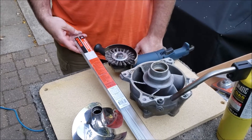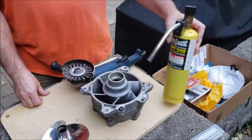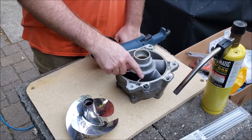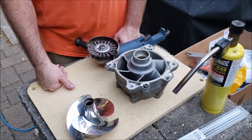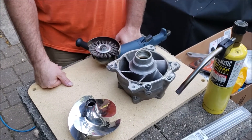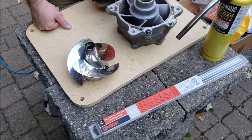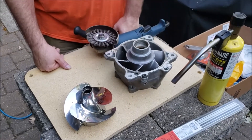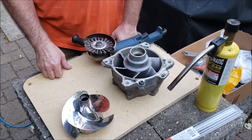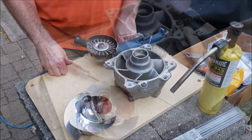What we're gonna do is use some brazing rod — the Hobart brand from the local home center — and a MAP gas torch. We'll wire wheel these clean them up, then build up a bead of brazing rod, which is like 80-some percent zinc and only about five to ten percent aluminum. That zinc brazing rod has thirty-thousand pound plus compressive strength — it's actually stronger and harder than the base cast aluminum in many ways, so it puts a good replacement surface on there.